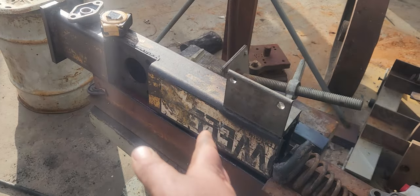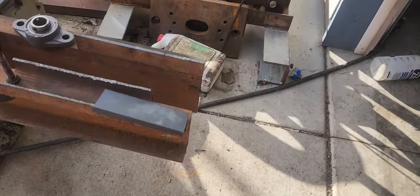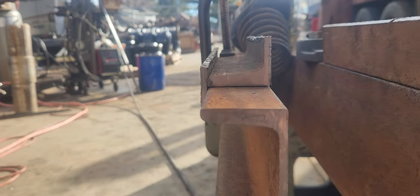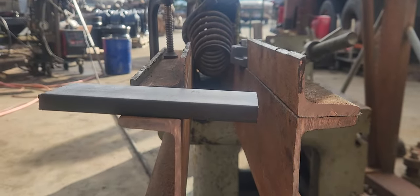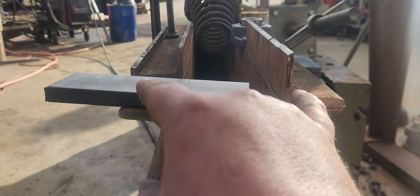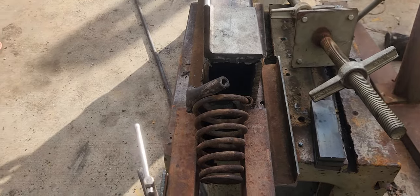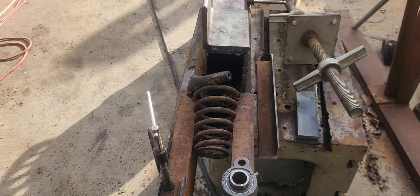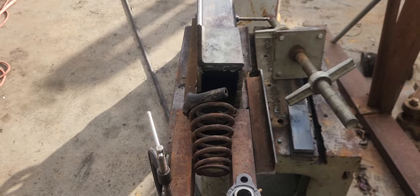That solves how long this was. The idler tensioning system has also been solved - I took the sections I cut out, cut them up, and they straddle this C-channel perfectly. This C-channel has an angle on it, and by using these sections I have a perfect angle, radius, and everything to guide my idler back and forth. I have four springs - two for each track frame - and they seem heavy enough to stand on without moving.